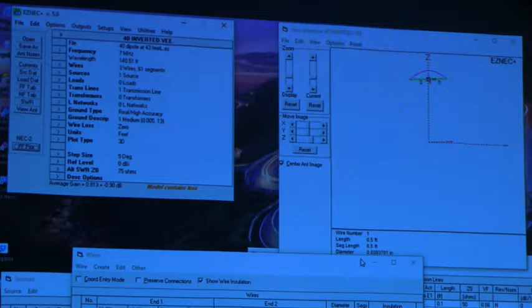That's why a dipole is very difficult on 40 and up. You've got to get it high for it to do any good. So, I mean, to get the angle down. You follow what I'm saying? It's great for local. It ain't worth a damn for DX.